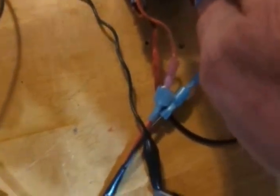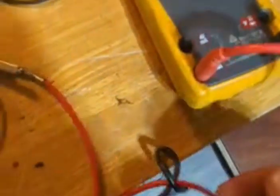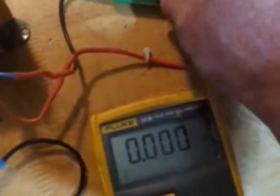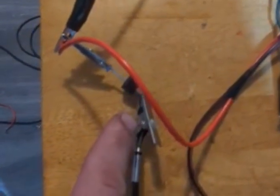This one's a bit sloppier because we have more going on. The variac and bridge rectifier — positive comes out to the red wire, which goes into the primary of the transformer. Out of the black wire, out of the transformer, into an alligator clip that goes back to the negative of the bridge rectifier. The multimeter leads — the red one's attached to the negative of the bridge rectifier, and the other is attached to the diode that goes to the positive. Exact same setup as before. The secondary of the transformer is on load. Let's turn it on and try to bring it up to 50 volts.